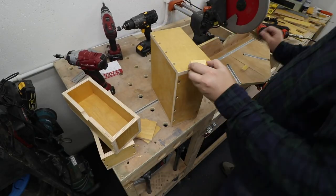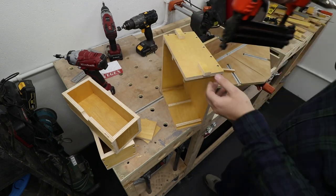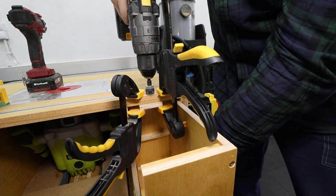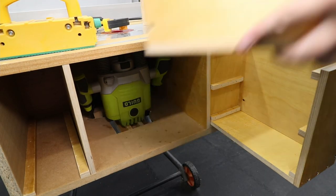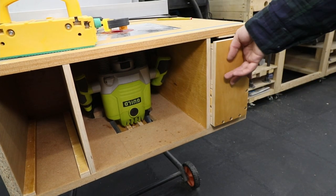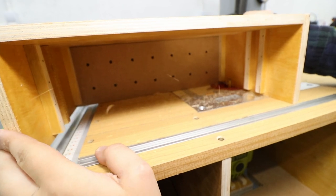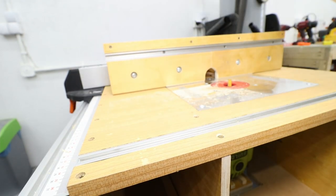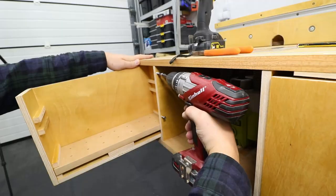In the same manner, I'm securing the drawer that houses the storage boxes so it doesn't fall out on its own. Through the top I'm installing a notch that I can remove whenever I want to take the drawer out fully, and now it stops as it should without falling out. For the second box, which is larger, I'm cutting notches on each side — four in total — using straight router bits, and I'm installing two bolts through the sides as my way of stopping that drawer from coming out fully.